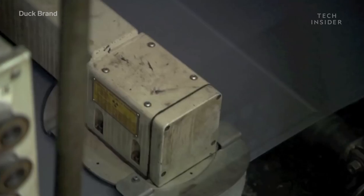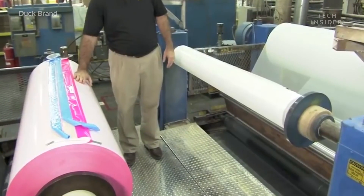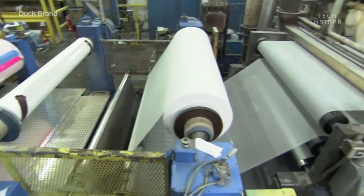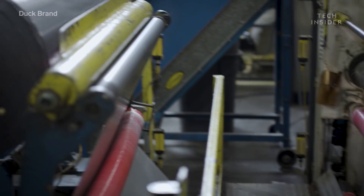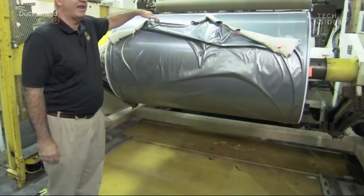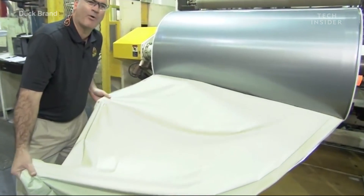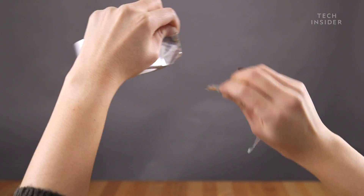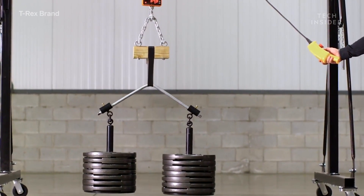Finally, there's the backing. The backing is made from polyethylene, the same plastic material used to make bags and shampoo bottles. Once the backing is ready, all of the materials are put together. There are basically two ways that the backing can be incorporated into the tape: either laminated or coextrusion. The coextrusion basically melds together the backing, the cloth, and the adhesive, giving you a stronger tape that won't delaminate and will perform well in different weather applications. Once the layers are combined, the strength of the cloth and the plastic-like nature of the backing combine to give the tape the strength and durability we know and love.